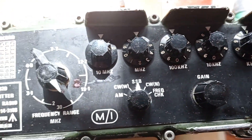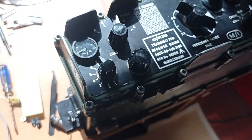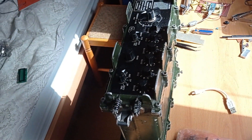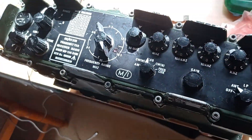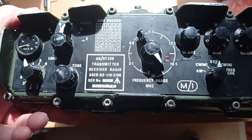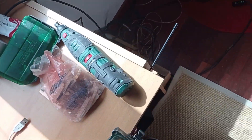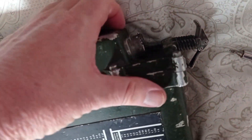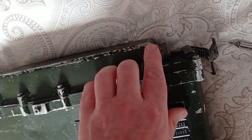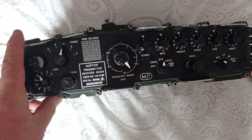Okay guys, it's time to modify my Clansman. This radio is in fair shape, but when I bought it for about 90 quid a few years ago I was quite lucky — it came with a multitude of faults. The power amplifier module at the back wouldn't work, which turned out to be a dry joint. There was no audio out, which turned out to be one of the thermistors on the back PCB hanging off — more dry joints in that area. Lots of dry joints in the power amp, and when I opened it up there were a few nuts and bolts floating about as well.